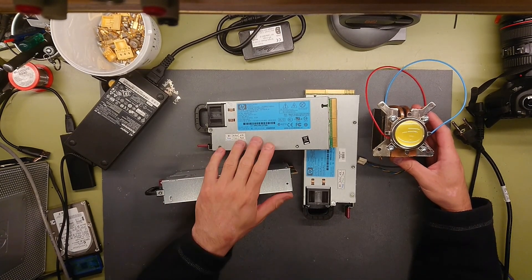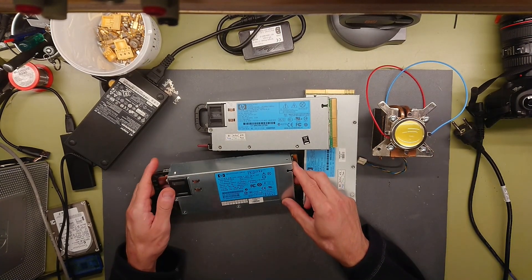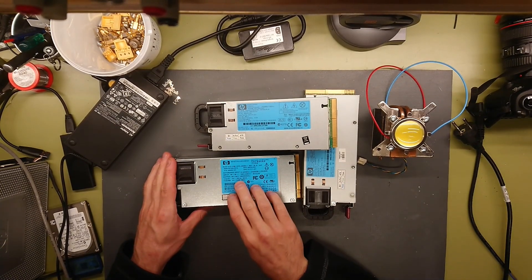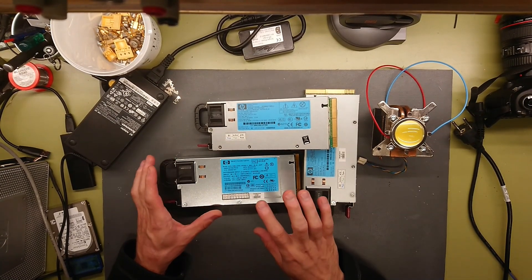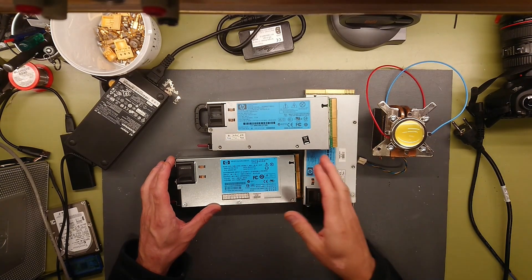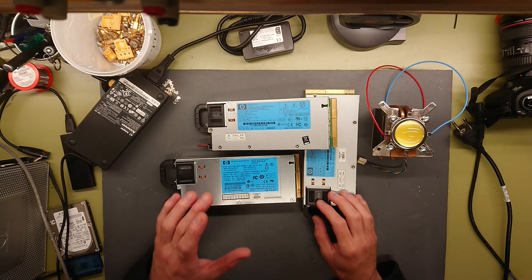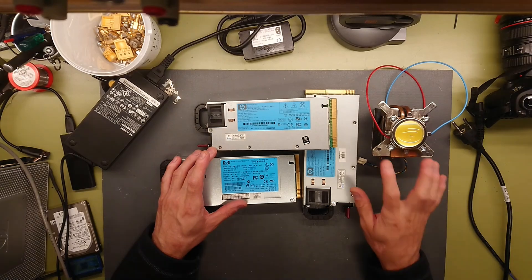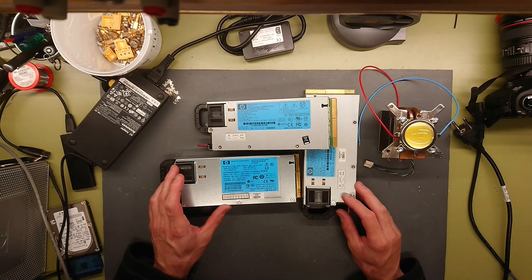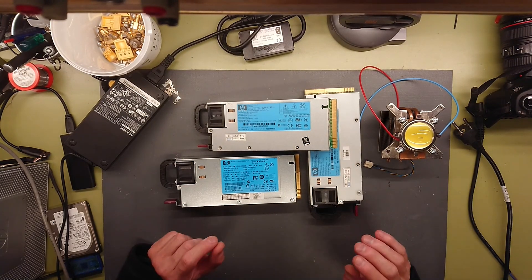The first option is these three server power supplies from HP. These are 460 watts each, so they can output 12 volts at 38 amps. I want to make these with floating ground and put them all in series, so I have 36 volt DC. I need pretty tight voltage regulation to not damage the LEDs, so first let's get one of these taken apart and remove all the grounding parts, so we can float them in series for 36 volts.